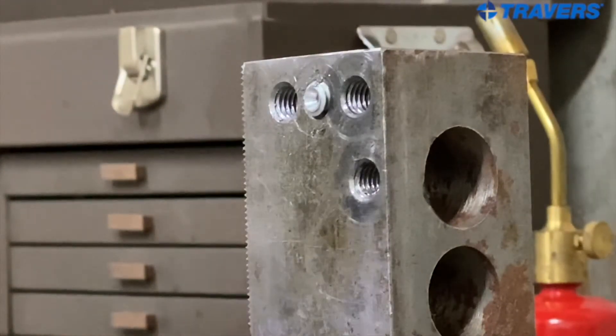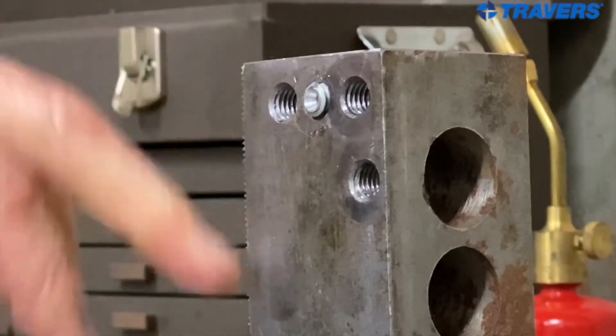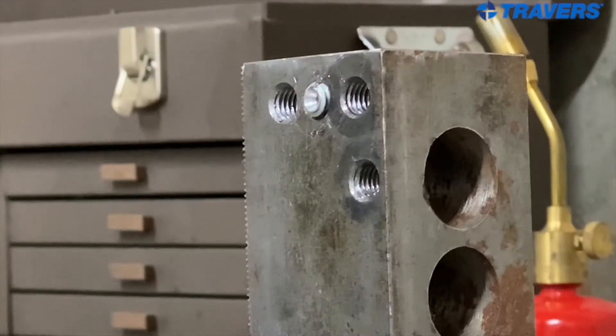It's not going anywhere, so we have to go to another step. But I do have a nice center hole drilled in there. That screw is not going to back out easily like the other ones did, so I don't need to continue with left-handed tools. I have just a conventional right-handed drill bit.